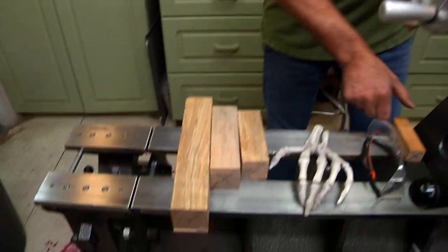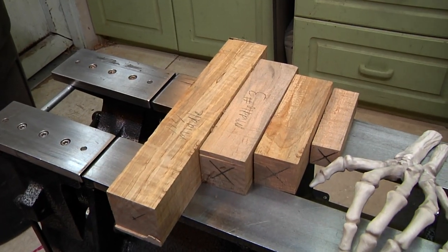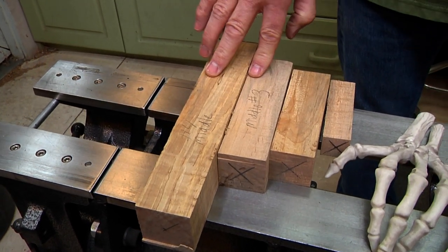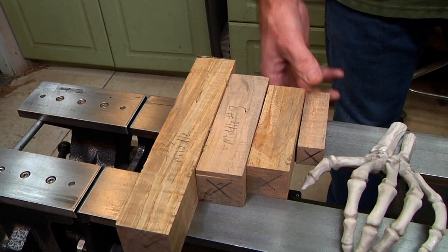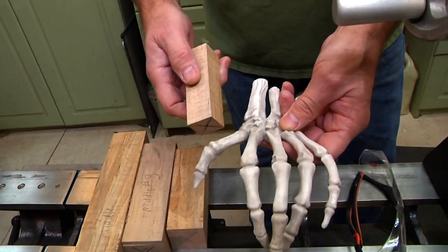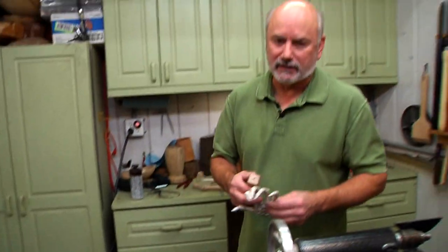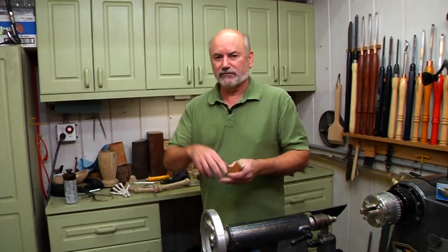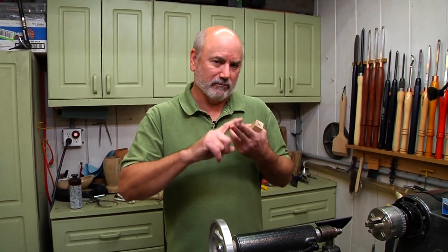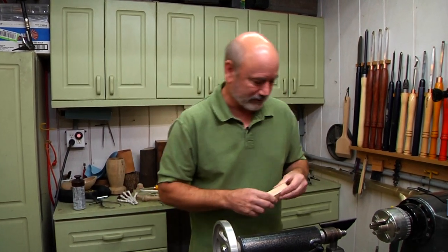I have these pieces for the middle finger right here and you can see they're all different sizes. We're going to take two different mounting techniques — these will take tenons, but these are going to go into a chuck and just be held by the chuck. There's a lot of bones to this, so you're going to have to cut out a lot of wood. Don't worry about that, because I'm going to make available a PDF — you'll find the link in the description — and it will have the measurements of everything you need to do, including the dimensions of the pieces of wood to cut.